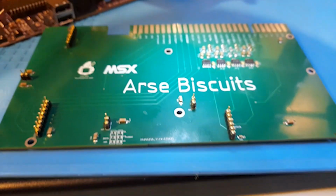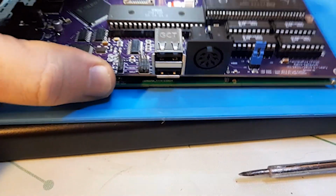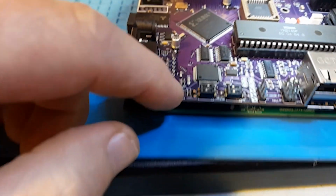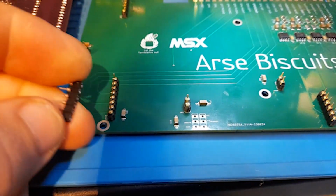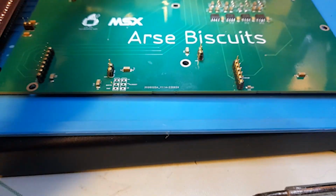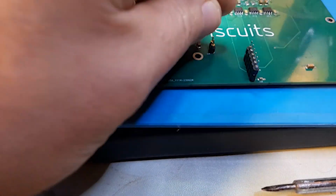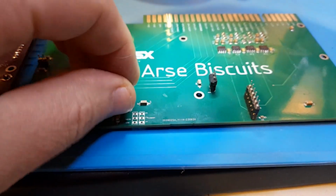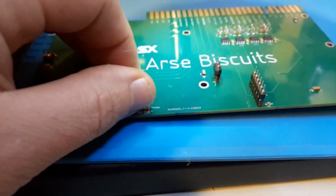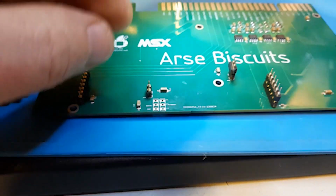It's essentially an interface board, but we need a few things to make it work with our board here. We need to put connectors under this board, these turned pin connectors. The way to make sure everything aligns, I'm actually going to put the connectors on here, put the board on top, and just solder them like that. So that way everything will be exactly aligned. There'll be no messing, trying to realign stuff and bending pins. So I'm going to do that next.